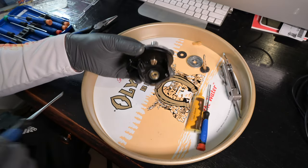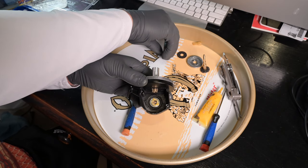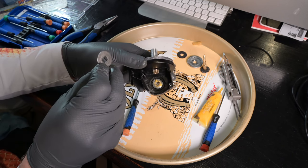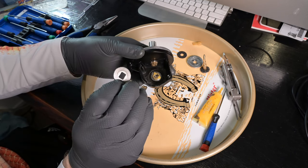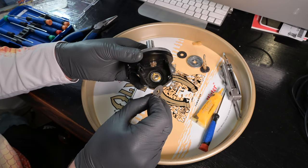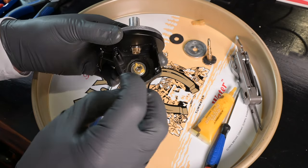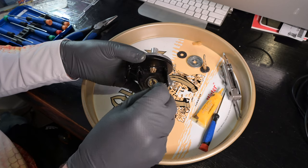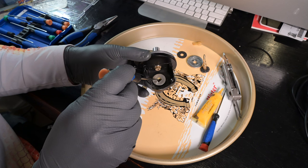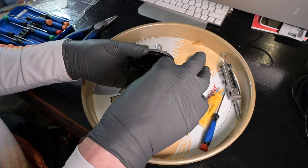I'm going to take some more grease and tag these. Now we're going to take our metal washer. There's a disconnect between the schematic and the diagram — the picture labels this washer as fiber but it's not. One side of this washer is bulged out and the other is indented; the bulged out section faces toward our main bearing. We slap that right on top of the brass washers. Then we take our fiber washer and lay that right on top of the metal washer.